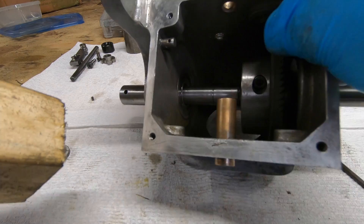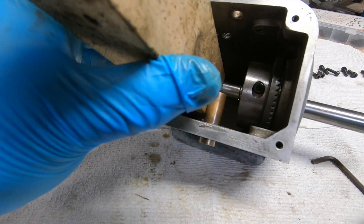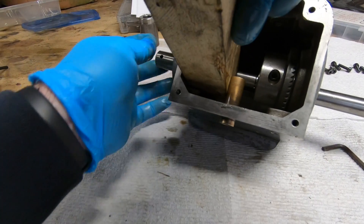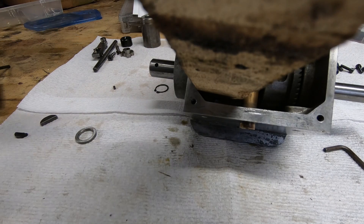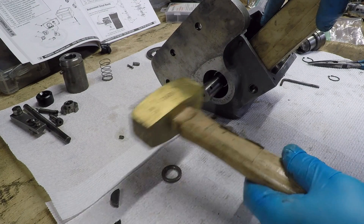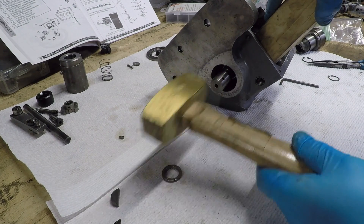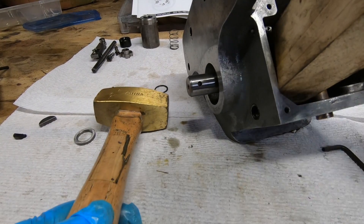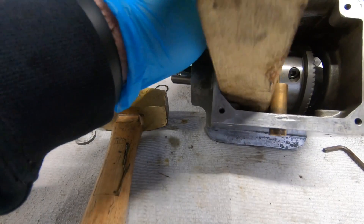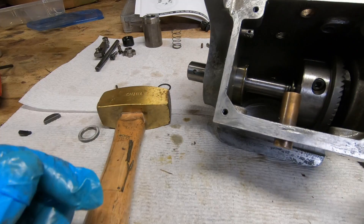I got the bearing reseated and reassembled to where it was before. So I figured I'd jam a cut-off piece of 2x4 in there next to the bearing so that when I'm tapping on the shaft the bearing won't move. And I'm sure some of you are yelling at your monitor — why doesn't he put the shaft in the other way? It's because the diameter on the very end of the shaft is wider than the ID of the bearing, it won't fit that way. It has to go in left to right — and of course this didn't work either.